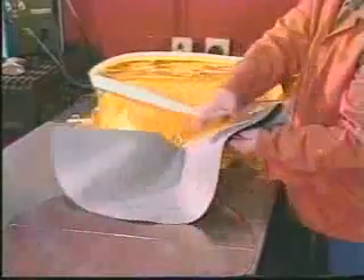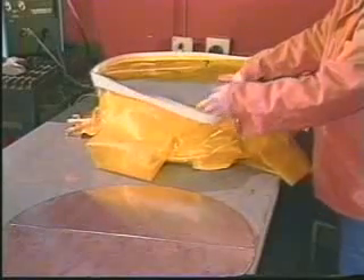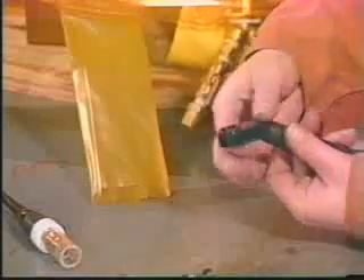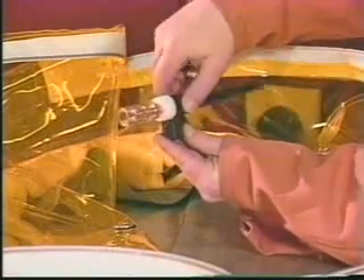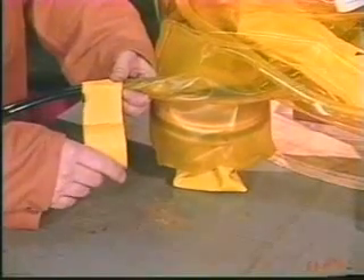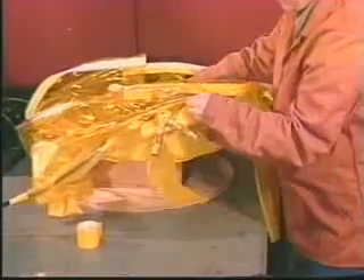Unpack the chamber and place it on a prepared tabletop. Open the chamber zipper and first install the heat blanket, then carefully position the inner base plate on the heat blanket. Pierce a hole at the accessory port entrance of the chamber most convenient for the TIG torch, then insert the TIG torch through the sleeve and into the chamber. The TIG torch front end parts may now be added. Use the tape provided to seal the port sleeve onto the torch cable. The ground cable, cold wire feed leads, and other accessories should also be installed through the accessory ports.